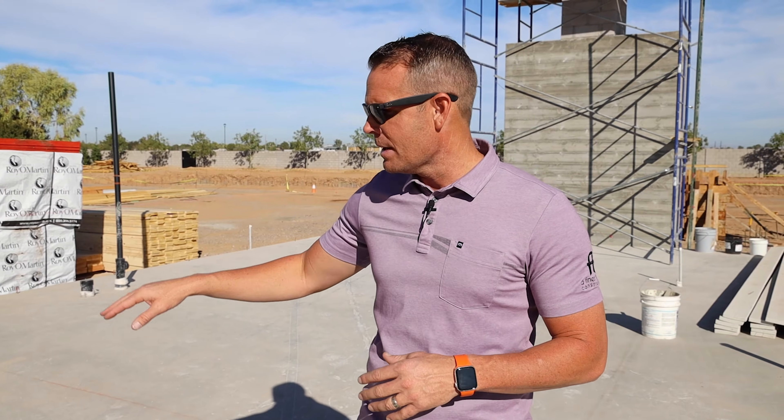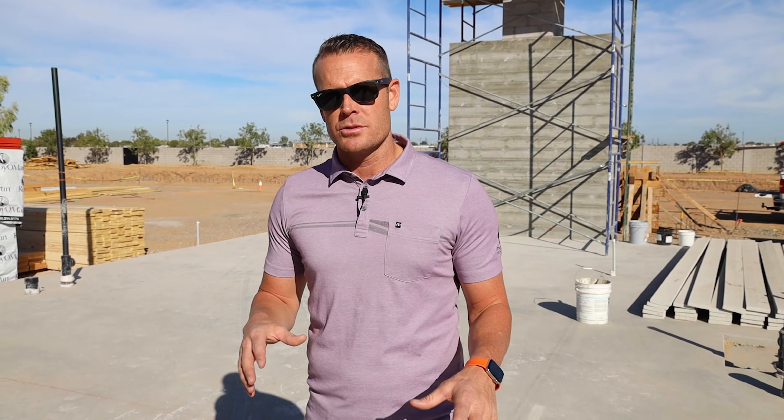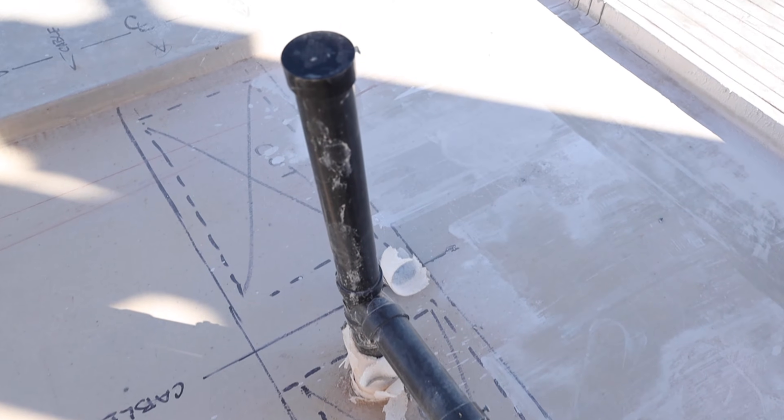What happens is there's an x-ray company — they come out and x-ray all the cables. They can lay out the cables, identify where they are, and then you can work around that as you're cutting. The guys in the field doing the concrete cutting know where the cables are — they're laid out, identified through x-ray — and now they can cut safely without cutting those cables.